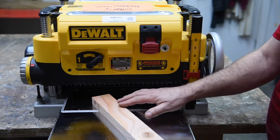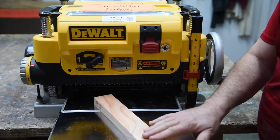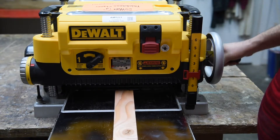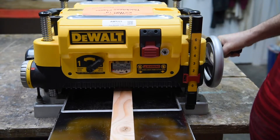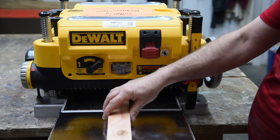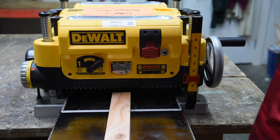Here's a piece of wood. Perhaps I'd like to plane it thinner and make it smoother. With the Makita planer, you would just walk up to it and adjust the depth. But it doesn't quite work that way with the DeWalt planer — I actually can't even reach the depth of thickness for this piece of wood, and that's because of a feature called the turret stop.